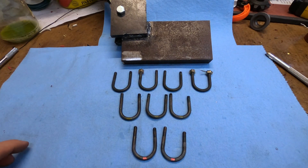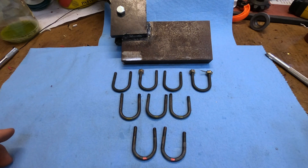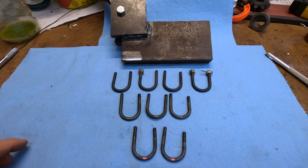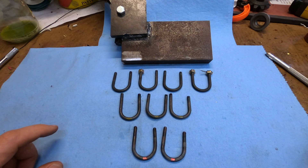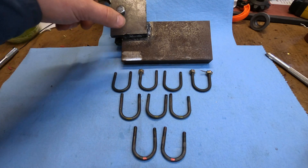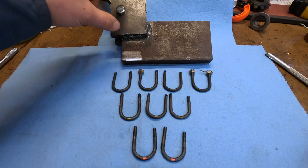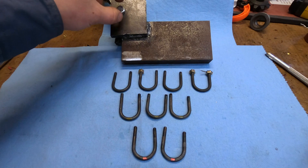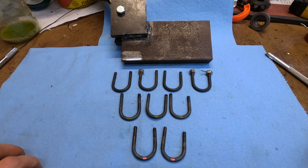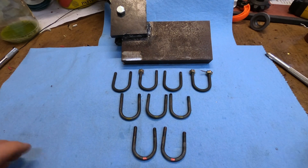Hope this gives somebody some ideas. My bending jig was inspired by the way some multi-purpose configurable benders, like the Hossfeld ones, work — obviously This Old Tony has a great video on those. There's also somebody else on YouTube that I'll link in the description who had a video for U-bolts made from all-thread in maybe 3/8 and 1/2 inch and a couple different inside diameters — that gave me an idea about the general layout. It would be cool to have a general purpose configurable version of this, but that gets a little tricky if you want to do different diameters in 1/16th steps, as the holes would be too close together. You'd end up needing shims, but maybe somebody does make or would make those. Hope this helps someone, and I'll see you next time.